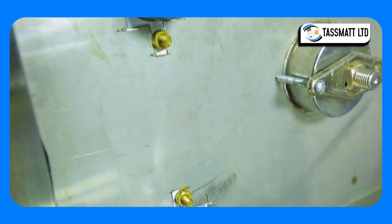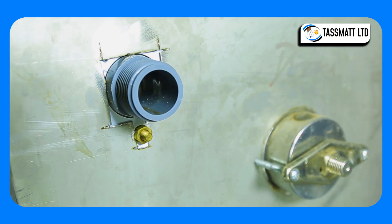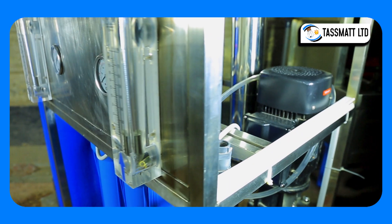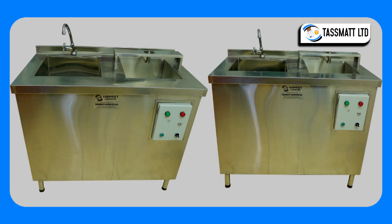The permeate is then passed through a chemical dosing pump with chlorine to adjust the pH, so as to maintain the natural taste and stability of water. It is also passed through an ultraviolet light to sterilize the water before it proceeds to the storage tank or filling station.